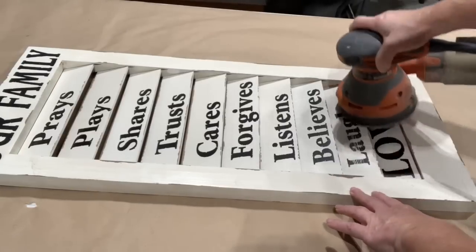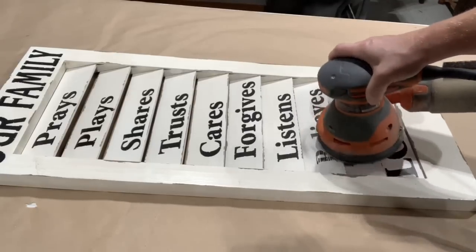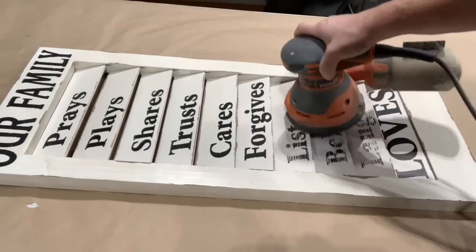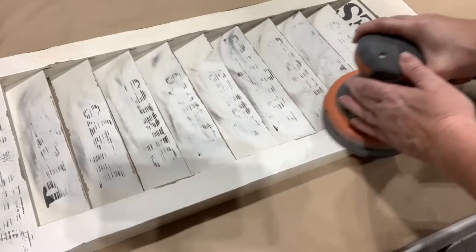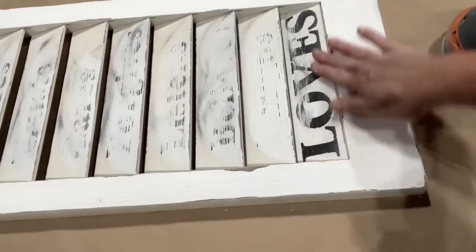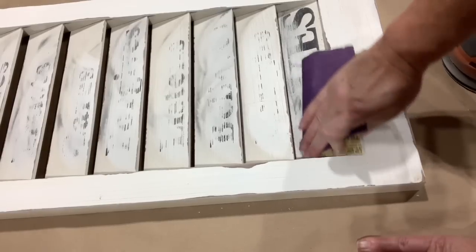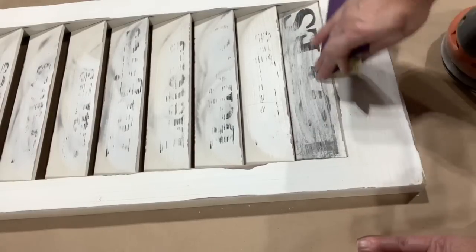For the shutter, I am going to be sanding off these words. I skipped that bottom word of love only because there's that edge there — if I would have taken this orbital sander and tried to sand it off, I would have taken that sharp edge off and made it rounded. So I'll have to hand sand that. Even though you don't feel it raised, a lot of times when you go to paint and distress, those hidden details will just pop. So it's best to try to sand the letters off rather than paint over them, because they are a little bit raised and they show through your paint.